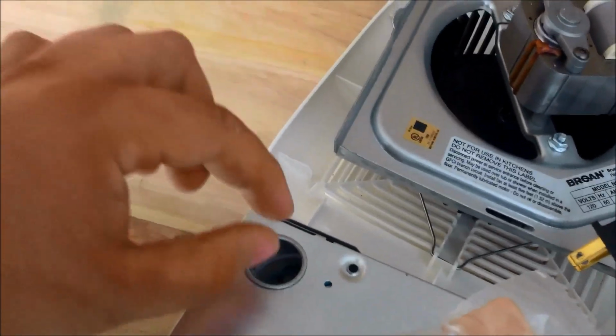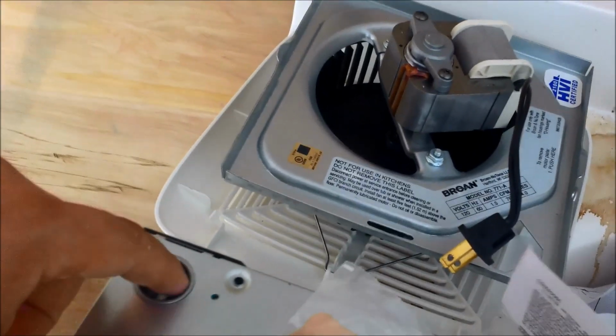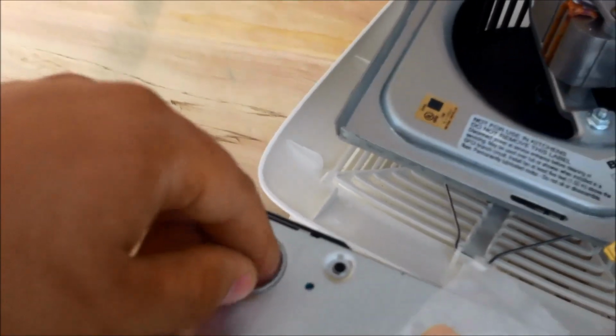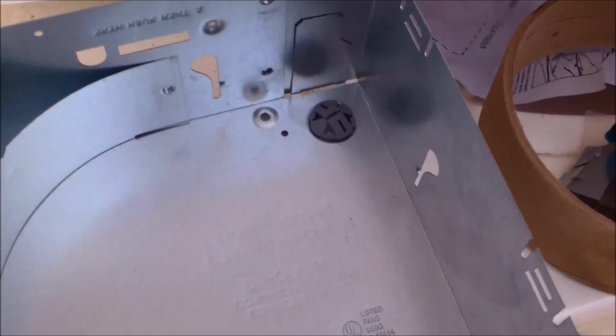There's wires in there. We're going to snake those out, and this is where you make your important wire connection. Right here. These are little fittings, what we use in circuit panels to run wires through. So this is going to pop in there, and that way you can have something that the wire can't cut itself on. Now, as you can see, this is actually an edge that's been folded in, so it's really not that dangerous, but I'm still going to pop one of these in there.